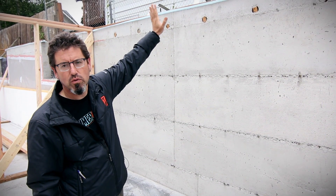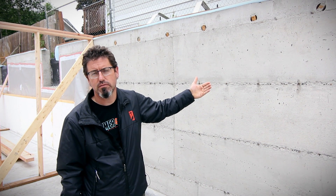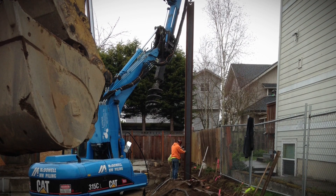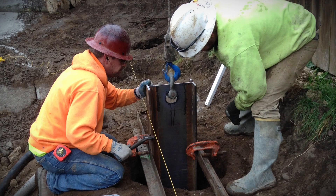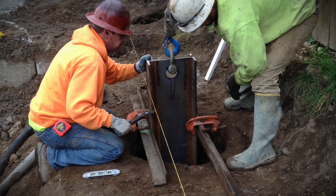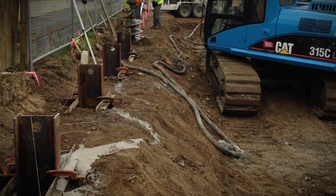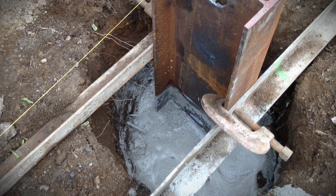We've got a new building next door which has a fairly shallow foundation. Since we have a very tight site, we actually had to do some substantial shoring work, and that required a very extensive foundation. We did not want to include any complications for thermal insulation between the foundation exterior — it was already a very complicated setup. So behind this wall, we have some soldier piles that go 10 feet tall. There are I-beams driven into the soil, encased in grout, with lagging between the soldier piles. We poured this 8-inch foundation wall directly against that lagging, against that shoring — so there's no way to get insulation on the other side of this concrete wall.